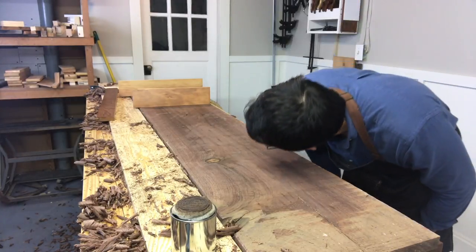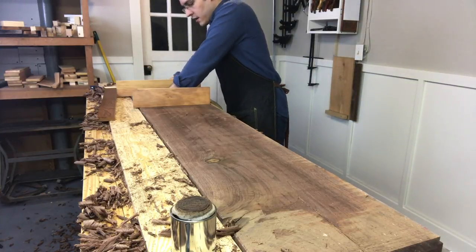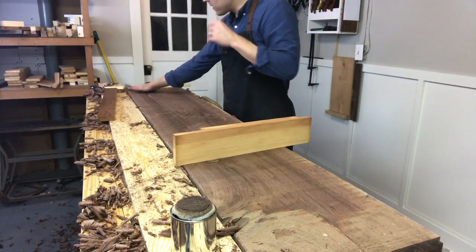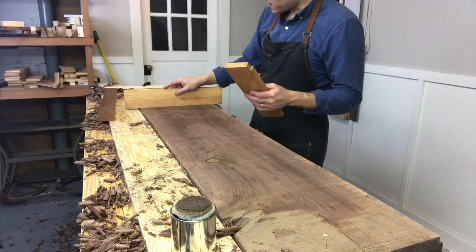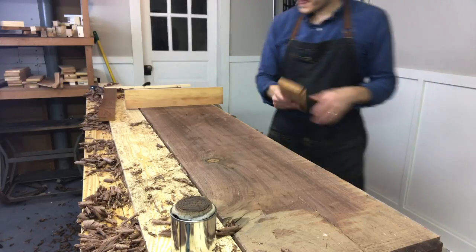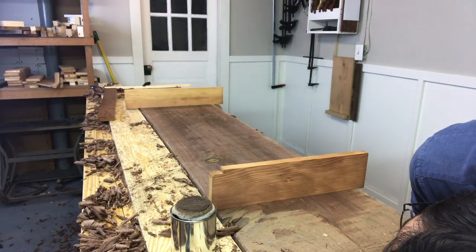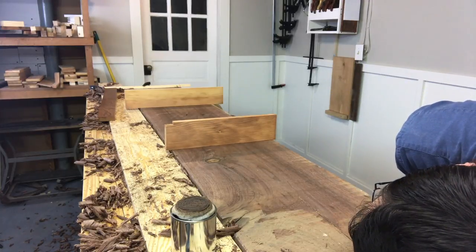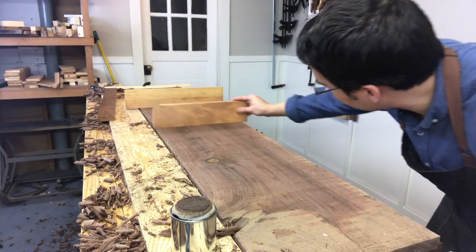Yeah, I'll tell you what it is right now. Yep, it's the back corner. This whole part, which I have never really flattened really well during this whole process, is just high. And let me do something different. I'll bring it up much closer where I'm pretty sure it's flat because I can feel the difference there. And we'll go from there and see what happens. Yeah, that's pretty close. Much closer. It's not exactly perfect, but it's really close.